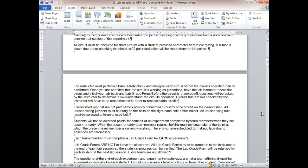Most of the other instructors don't follow this rule, and I come over to check a circuit and there are modules all over the place, modules on the table, 208 volts up there. We don't require steel-toed shoes, and if you're moving things around and knock one off, it could cause injury. Make sure those modules are stored under the table or on the cabinets.